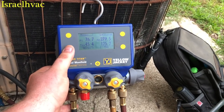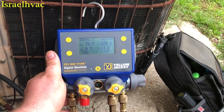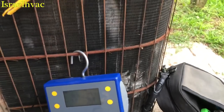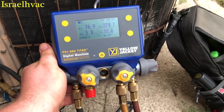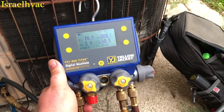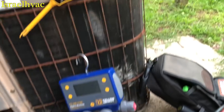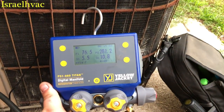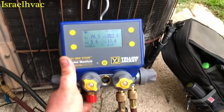Evaporator's come up to 45. We're already at 6 degrees of superheat and the target's 5. So we dropped the superheat down in range. This really isn't a how-to-charge-a-system video. I knew my system was a little low on charge — I could tell today because it's been struggling the past couple days. And I figured, since I knew I was going to have to put gas in it today, what better time to do a review on this manifold.